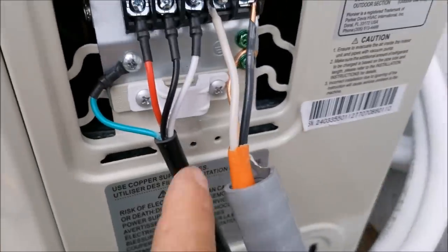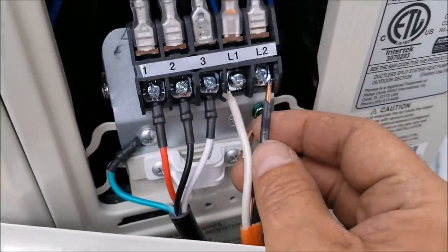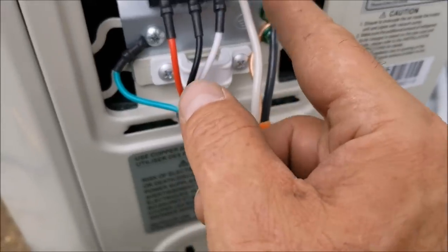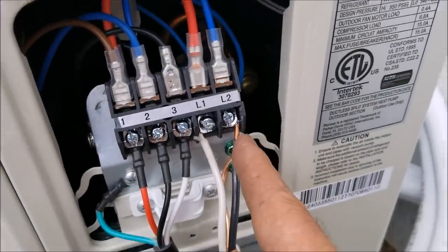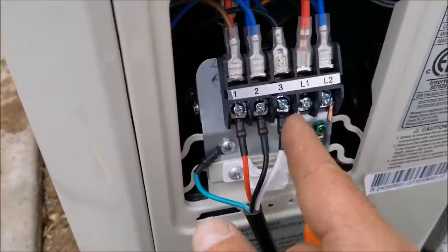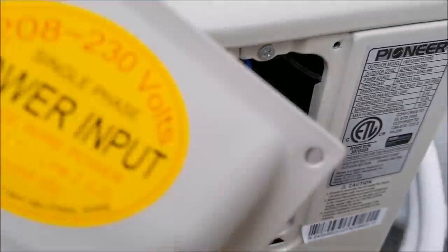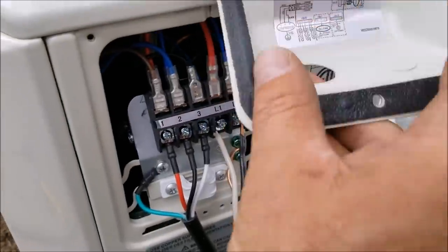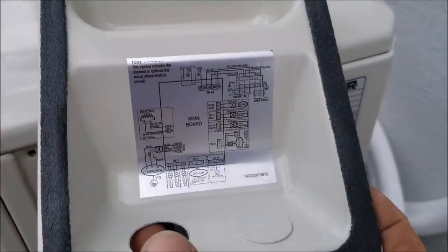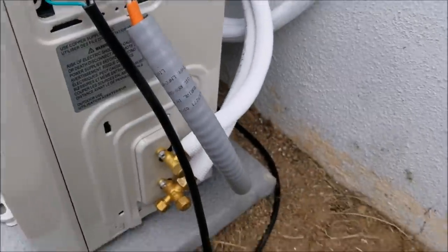I got the right fittings and the wiring is all in. This side is coming from that electrical box over there, and this is from the inside unit. Just make sure the terminals match what they are on the inside — I need to double-check since the wiring color code was off on mine. Look at your instructions and check the label on the inside of the lid too, so there shouldn't be any problem. The next step is going to be to vacuum it down and get all the air out of the lines and make sure it's all sealed up.